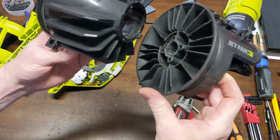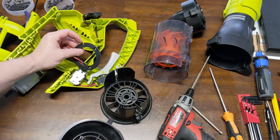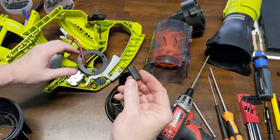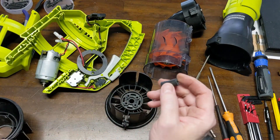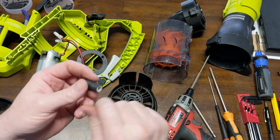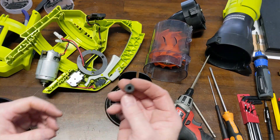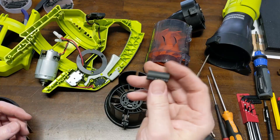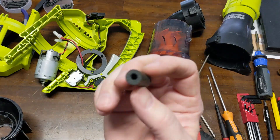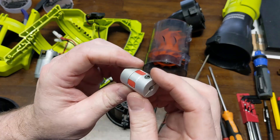We do have a key here to pay attention to when reassembling. We also have a notch for the motor support. What I had on here for a coupling was a piece of reinforced fuel line — a heavy rubber line I just used to get by because I couldn't find a coupling. The original style coupling just either cracks, splits, slips, or rounds out. I got a little bit of life out of the hose — it's 3/16th hose, not the typical quarter inch. It was snug but still would slip, and I couldn't use it in turbo at all or it would squeal — just a makeshift.